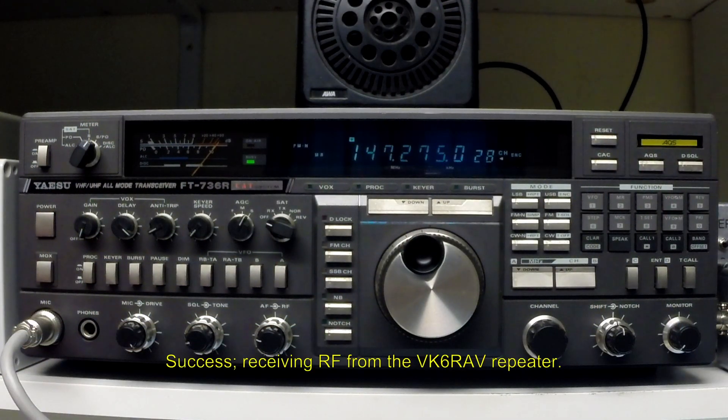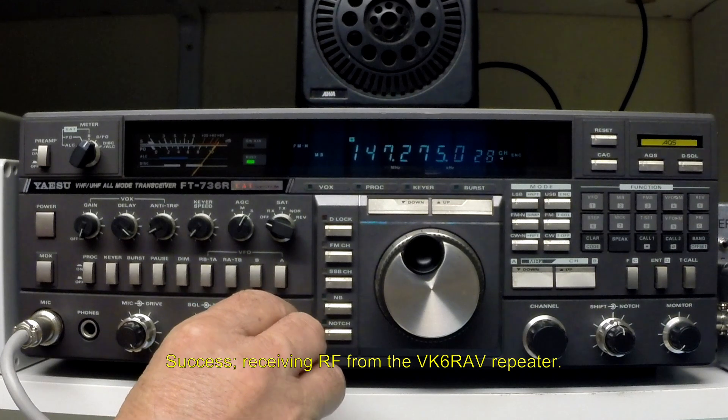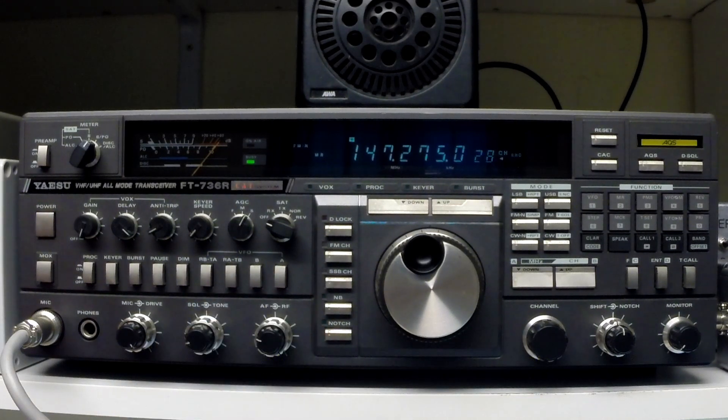I'm on the 706 so it seems to be working — just thrown it into the corner here. I hope there's no hum on the transmission because I didn't check the AC content. It's chugging out plenty of DC — 14.2 volts — so I think I'm back in business for the time being. That's a good start.